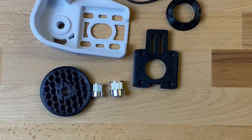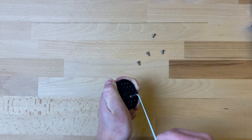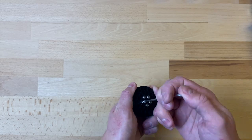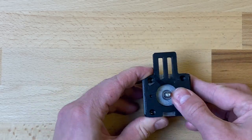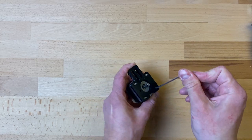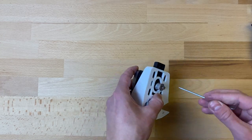For the 20-tooth pulley with the 8mm bore, you have to remove the flange. We will start with the assembly of the transmission — for this you will need the parts as shown. Insert the 20-tooth pulley into the printed pulley and fix it with 5 screws. Remember to put in the nuts before you screw the tensioner arm to the motor. The 16-tooth pulley doesn't need to be aligned precisely now — we will take care of that later. Please use washers when you bolt the motor to the transmission body, and you will also align all of this later.